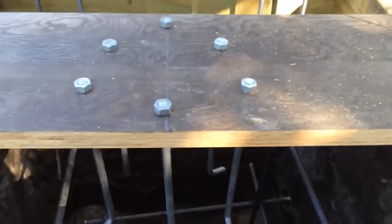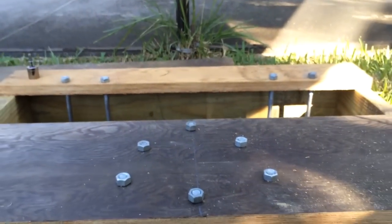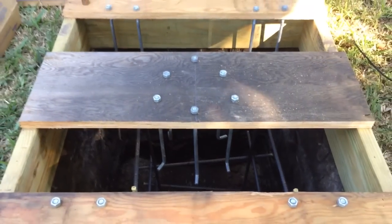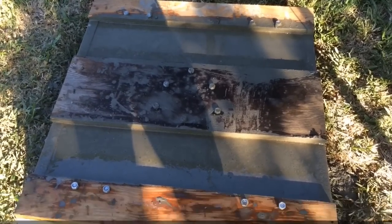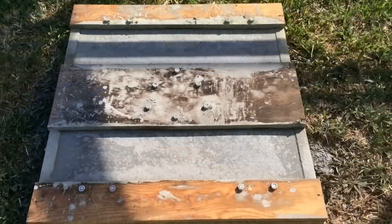Today's the day. The concrete truck is here and we have the hardware in place. As you can see, the anchors are 12 inches long and we've got just enough thread exposed. A little dark in there, but you get the idea. You've got the aft support back there and then a forward support here. We've got all the concrete poured in there — had to do it by wheelbarrow because the truck couldn't fit in here. This is after day one.